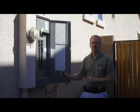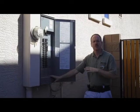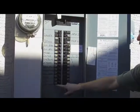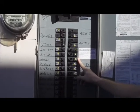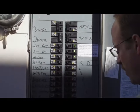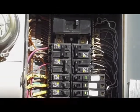The main electrical panel is located on the outside of the house on most Phoenix, Arizona homes as a safety feature, so the utility company can easily shut off power if there's an emergency. On the panel, we check the main amperage coming into the house and make sure all the breakers are properly labeled. This is a newer house, so it has arc fault breakers, which protect bedroom outlets and light fixtures — we test those to make sure they're properly operating. We also remove the cover of the panel to check that all wiring is properly connected and there are no signs of wear or deterioration inside.